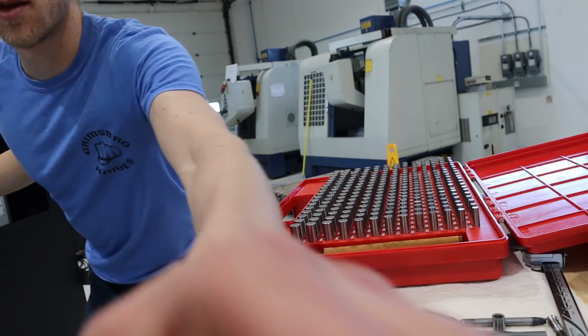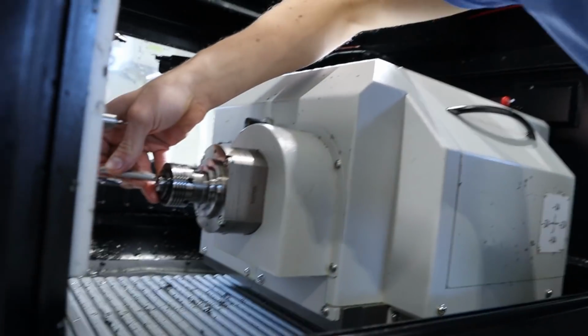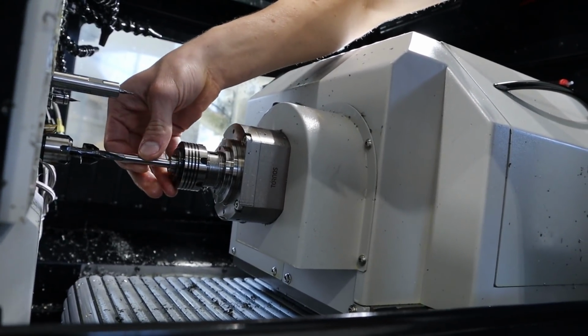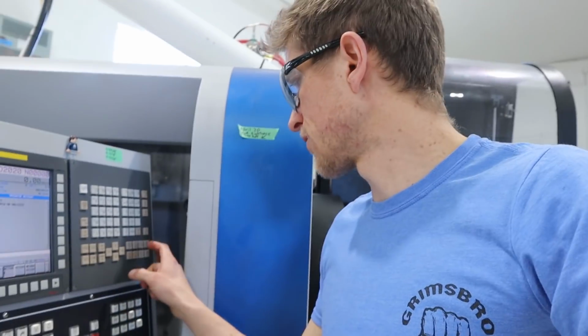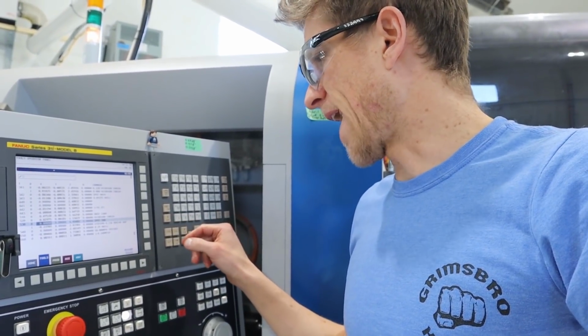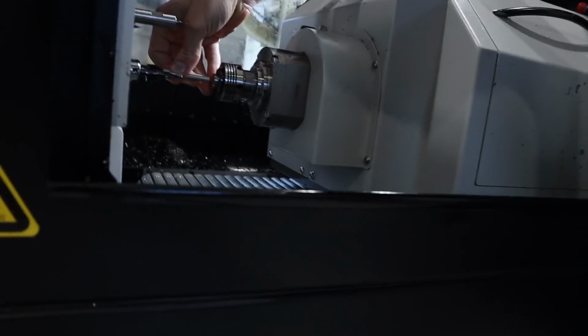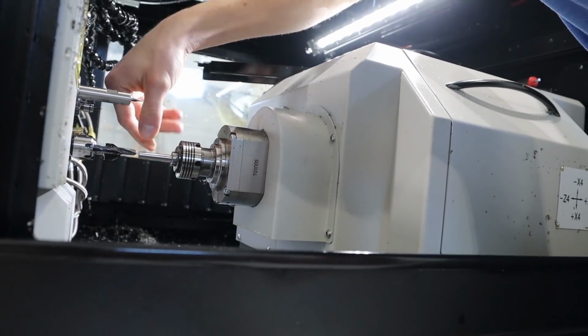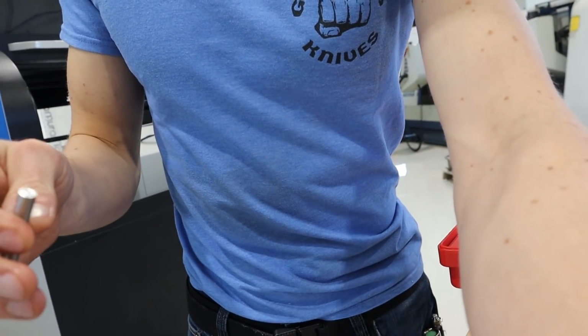Yeah. So a .296 fits easily, and a .297 didn't fit. So I'm like a few tenths under, which is fine. Totally great. But just for fun, go to the offset screen and I will, what tool have we got here? 530. I'm going to add just a little bit of wear on it. Should be fine. .305 pin. Ooh, like a glove. Good, good, good.